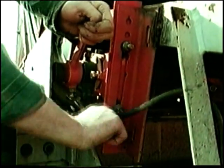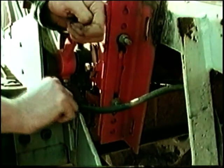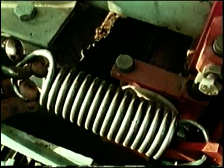To replace the blade, all that is required is a little skill and common sense. The blade fits neatly into the trough and is held in place with 2 bolts. The tension of the unit is adjusted from outside the conveyor by tensioning springs either side of the unit. The tension is measured by ensuring the gaps between each coil is approximately 2 millimeters.